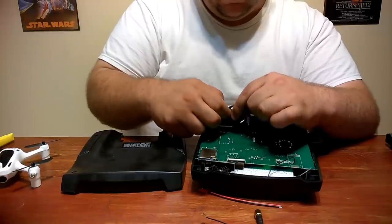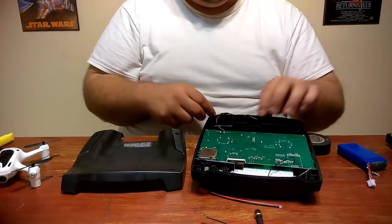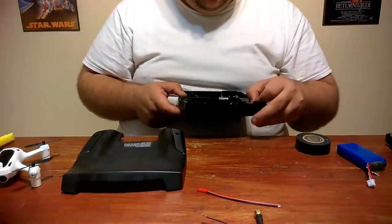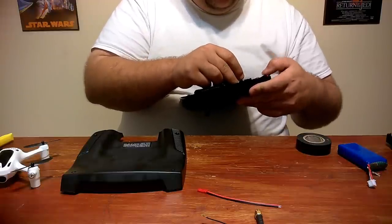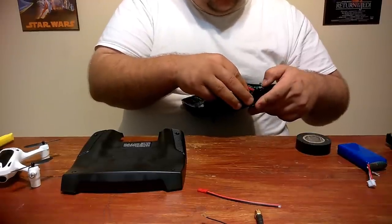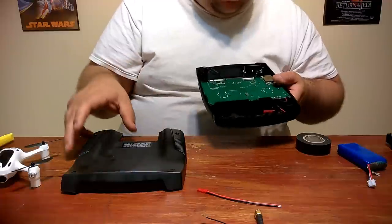You really don't want these wires to touch because they're going to be running 7.4 volts. If you guys want to know, the board can handle 4 through 13 volts - I'll show you right now, you can see it right there: 4 to 13 volts. The JST connection is now in there. We're going to go ahead and push all that extra wiring back up underneath the board and just leave out enough that we can use.